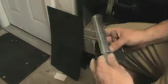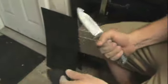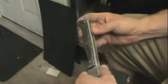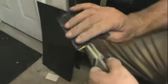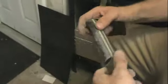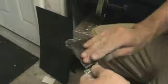Alright, so now the handle fits the way I want it to. It's the size I want it to be. But I've got to worry about all the surface scratches that I made on it on the machine. So that's what we're doing with the hand sandpaper. We're just going to make sure everything is nice and smooth. And we're going to start with the 220, same grit that we were last on the machine. Reason being, I did a lot of the side or horizontal grinds on the machine. So now I'm going to start making everything go parallel to the knife.